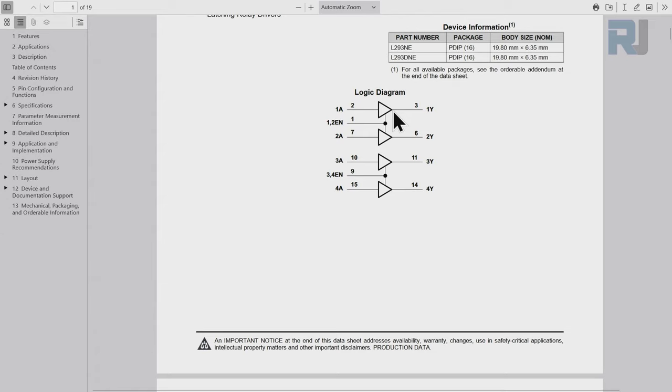For a real application you don't need these for-loops - they're just for demonstration. Let me save this as a new file so I don't change the original. I'll remove the bottom for-loop and set a constant value of 180, with channel B at zero. Upload the code with the motor's 5V disconnected. Code is uploaded.